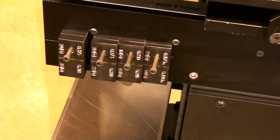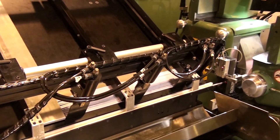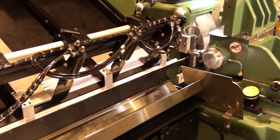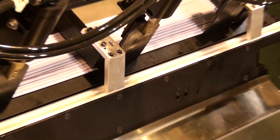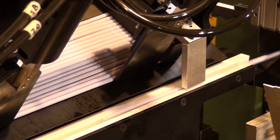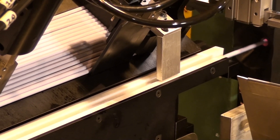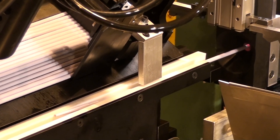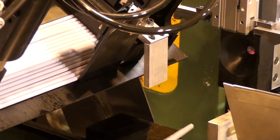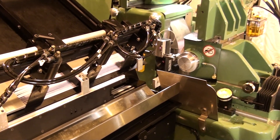It is length adjustable up to a 4-foot maximum. There are parts segregated to permit only one part to drop into the load carriage. The load carriage clamps a part and travels toward the grind area. It delivers a part to the fiber optic part present sensor at the funnel zone. The funnel zone gripper holds the part in position.